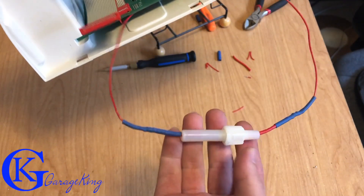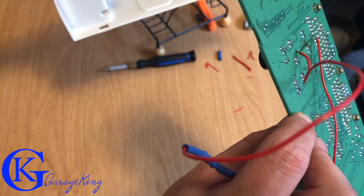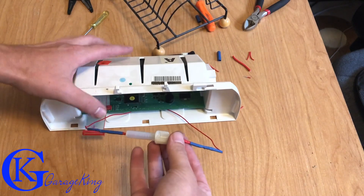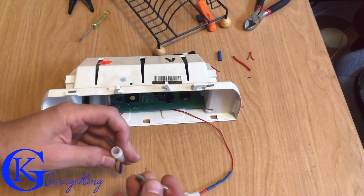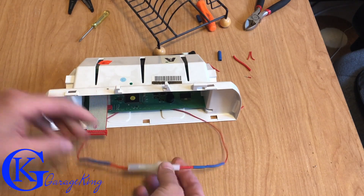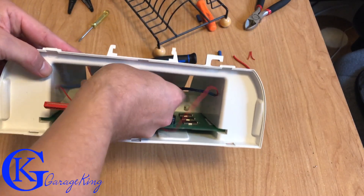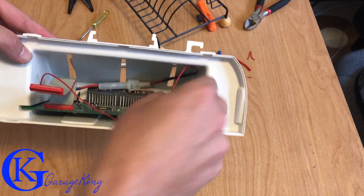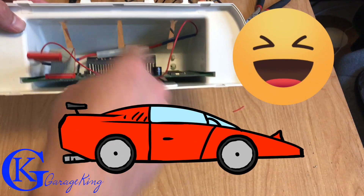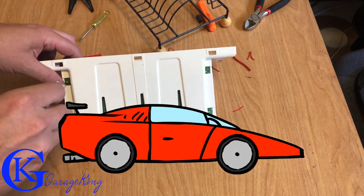Here's a quick summary of how it looks — there's the fuse holder, I can slide the circuit board out, and there are the connections. Let's put it back in, then we can put our 1.5 amp fuse in and leave the fuse on top. We'll tuck the wires up nicely at the top so they won't touch anything. It's a Jaguar, not an off-road dune buggy, so nothing should come loose — it should be fine just like that.